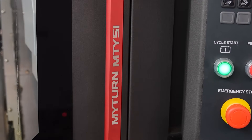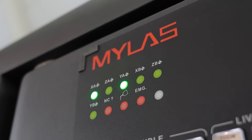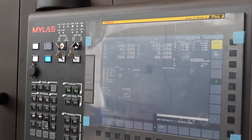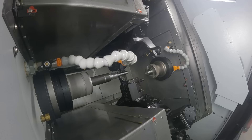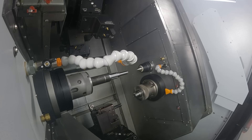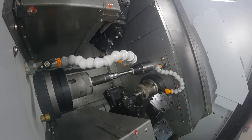What I like about this is it's not just the 51 — you've got a bigger machine as well, up to the 65. And when you talk about some of these features, you're using the FANUC 31i series control here, which is obviously a really powerful control. I wouldn't expect to program it on the machine though — I'm guessing you have some kind of support package? It's much more easy to program. There is a kind of guide that helps you through the program to show you what you have to do, so the person on the machine always gets help to program in an easy way. A lot of people working on the machine don't need to know exactly the full syntax, and this machine shows you what you have to do and guides you through the working so that you make a really good solution.